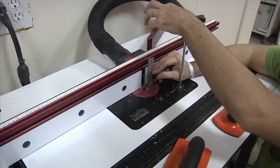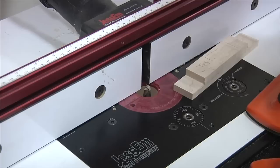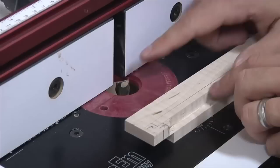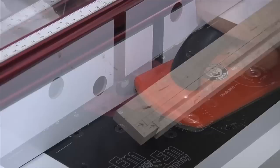Before cutting all the back panel rabbets, I lower my bit to just under an eighth of an inch. I do a test run with a piece of scrap, then test with my actual back piece material to confirm it's flush. Now that the bit height is set, it's rinse and repeat. Since the cut is only about an eighth of an inch deep, it won't stress the bit very much, so we don't need to work our way back step by step — we can go right to our line on the first shot.